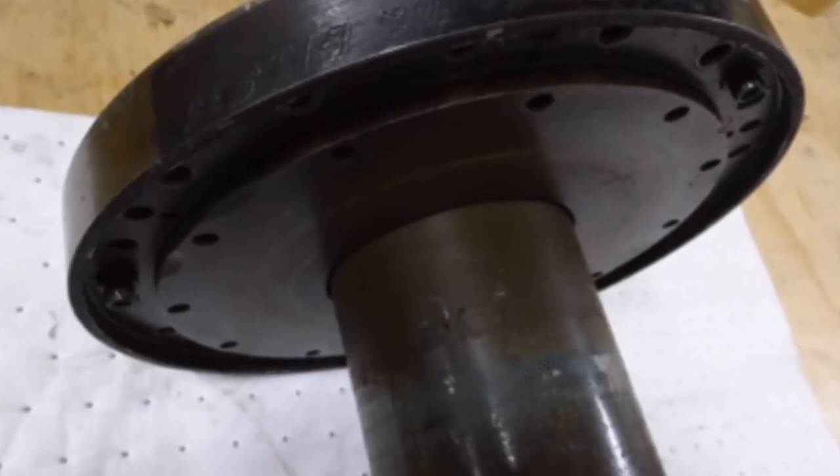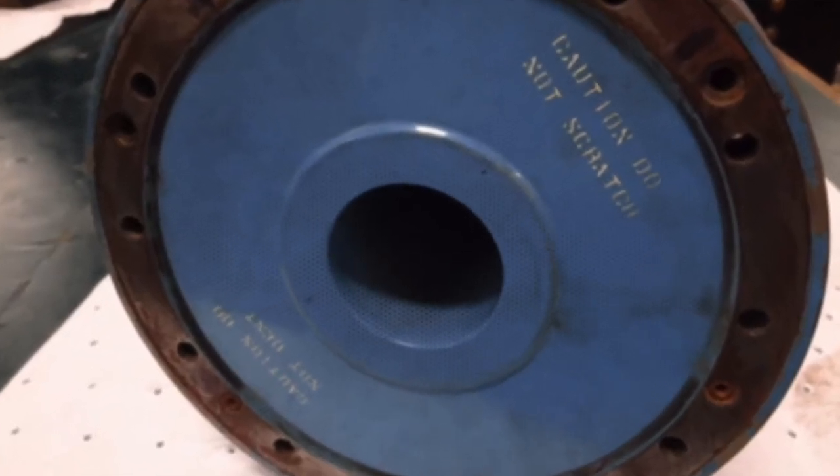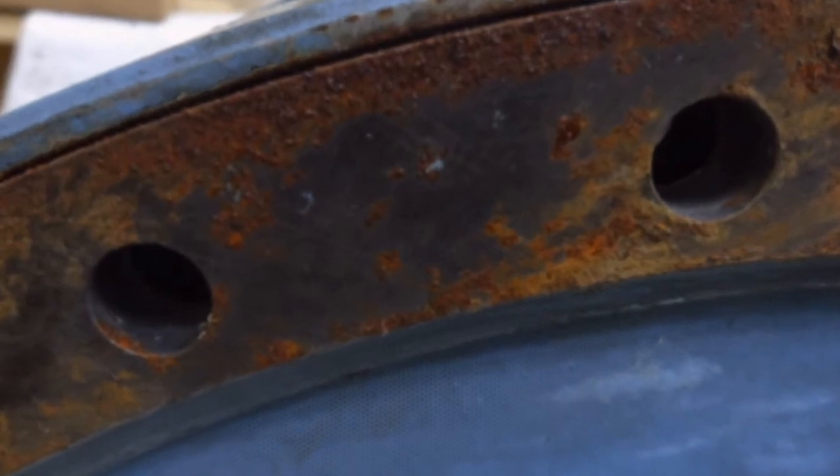When a coupling is sent back for repair to a facility, the first thing that's going to be done is a visual inspection. The first look of the coupling can tell us what the coupling has seen. The paint on the coupling has been used for many years to see just what has happened from a temperature standpoint. When you see a coupling with no paint, as you see on my screen here, it saw significant heat to burn the paint off. In some cases it's just turned black, maybe slightly brown. After looking at the paint condition, the next thing to look at is your flange mating surfaces. A lot of times these will be severely corroded. Corrosion is tolerable to a certain point because it can be machined off. The length will slightly change, but shim packs of the coupling allow for adjustment of that change. If the corrosion is too severe, the coupling will have to be replaced because it's a one-piece welded construction.